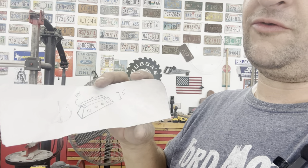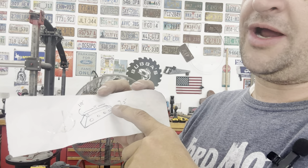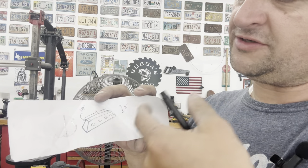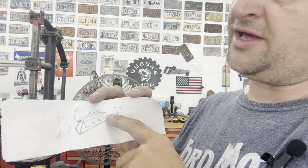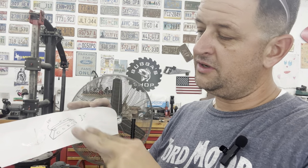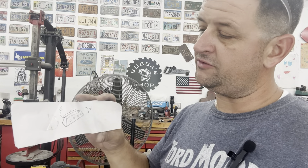I'm going to build four of these — two for driver, two for passenger — and have my holes in the top there for the track to bolt to. It's a short two-and-a-half inch tall panel. If I have room, I may put my small dimple die in there and bust a few holes in it just to kind of dress it up and give it some strength. It's going to have a taper to it, just to keep it from being a simple little box welded to the floor.